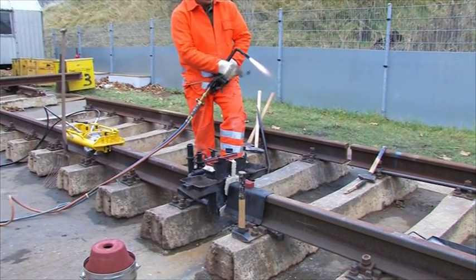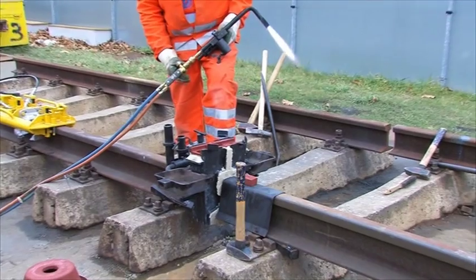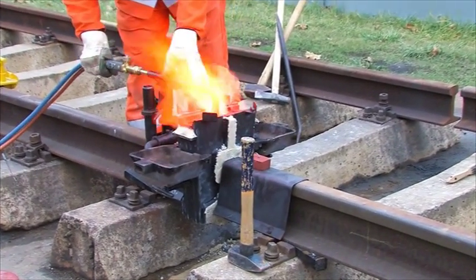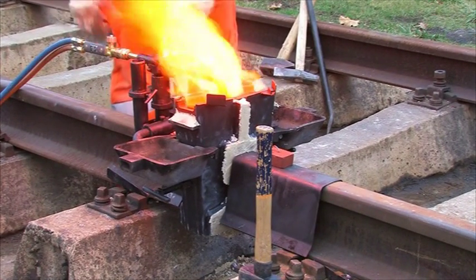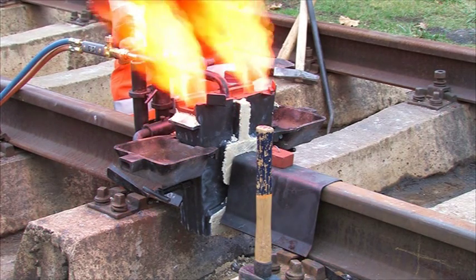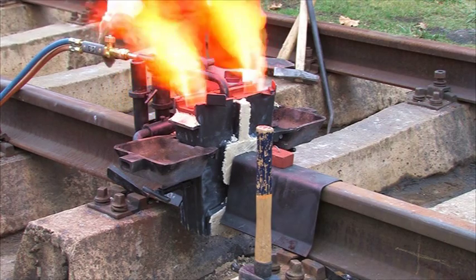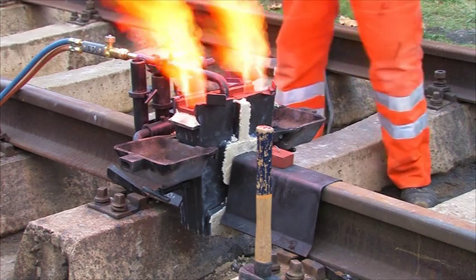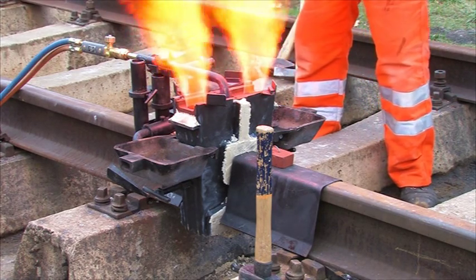The burner saddle with inserted torch is set up. Then it shall be fixed and adjusted. The oxygen valve on the handle shall fully be opened. Now, by slightly opening the combustion valve on the handle, install a combustion excess in the flame. The torch flame develops a rattling noise. Then close the combustion valve at the handle only until this rattling noise just disappears. Therefore, an improper oxygen excess is excluded in the flame.